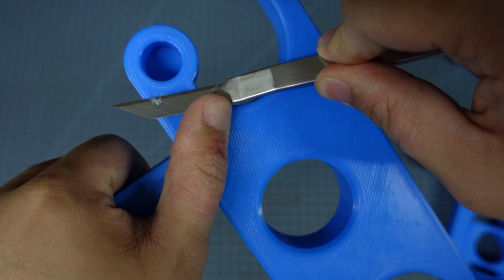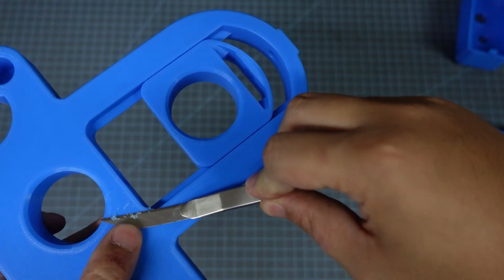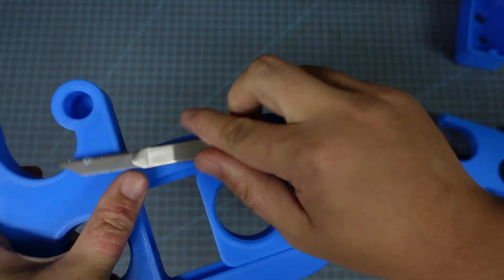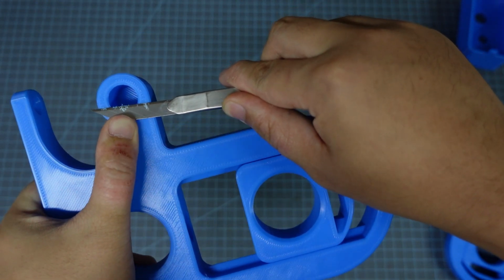I think it's a pressure advance thing, but anyway, I'm going to remove the peaks from these little ridges, and pretty much anything along this top path, so this middle spot right here. If yours is already smooth out of the box, then don't worry about this. If you do ironing, I think it also removes this problem, but something for the long run to do.